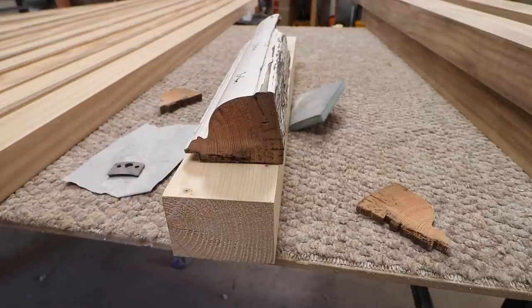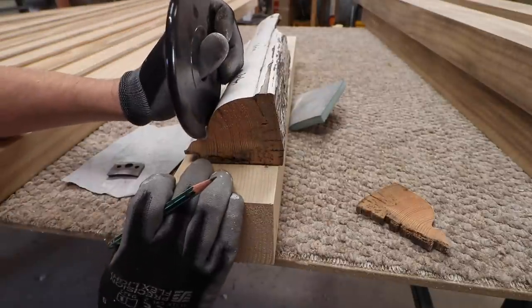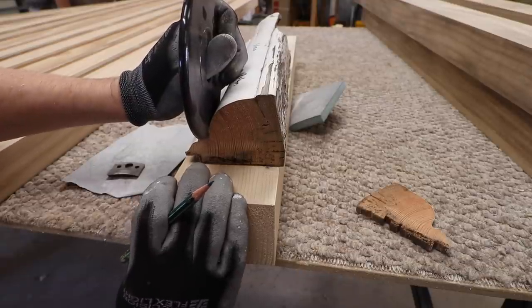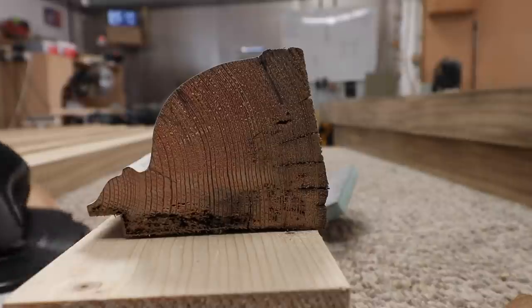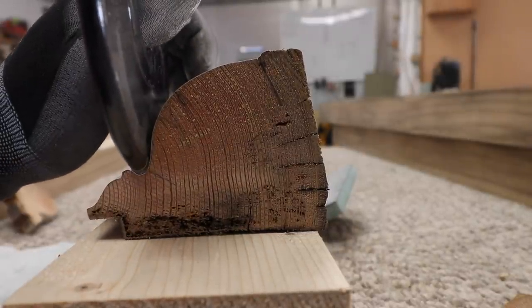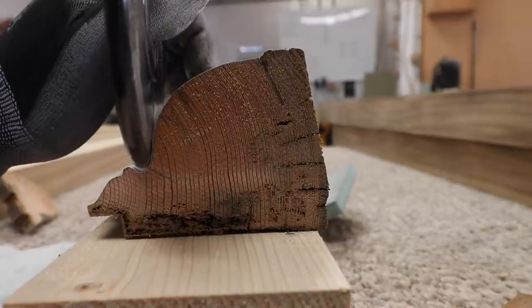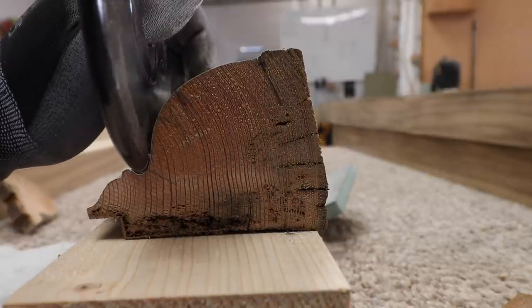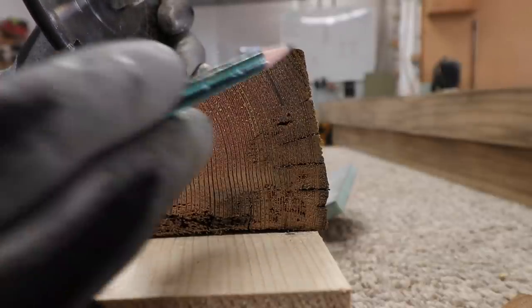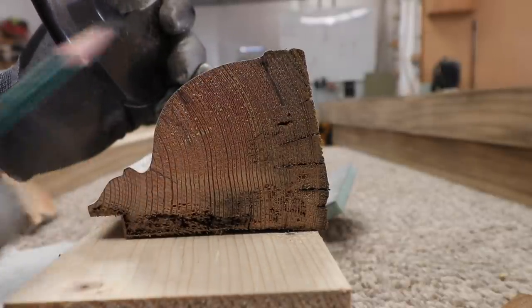This little groove here, I think we'll make do with this 8mm groove cutter. I don't know if you can see that. Okay, so we'll take that last little divot there out with this 8mm cutter, and that should hopefully have the depth to reach there, because that's quite a deep cut against a full square profile of timber.